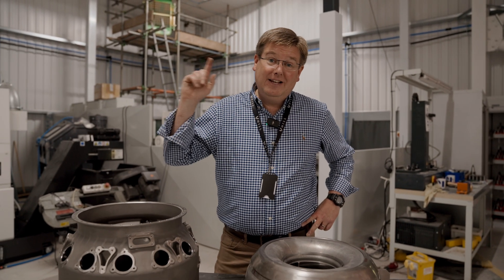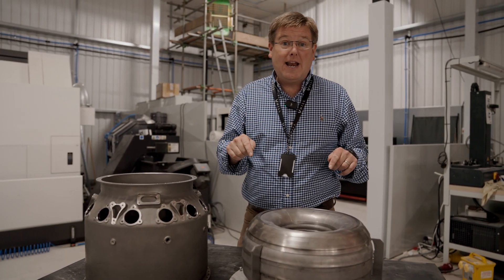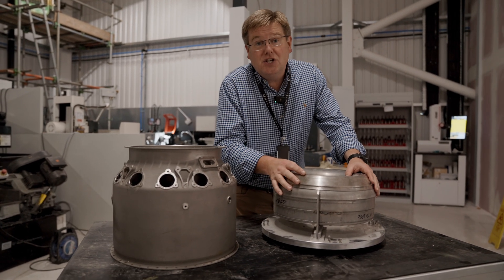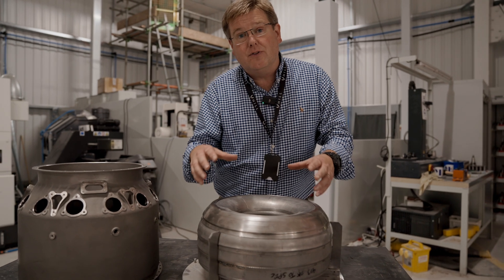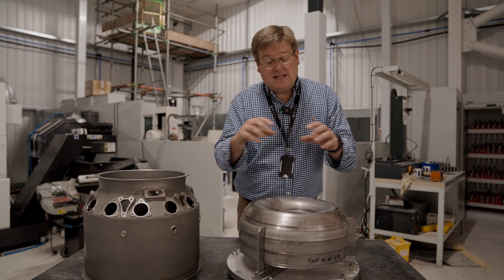With the compressor wheel in production and turbine blades in production for both prototype and series production, we need to just finish off the combustion liner now. You've watched us over the course of the last nine months or so develop all of the processes necessary to make the complex sheet metal fabrications out of super alloy. The final piece in the puzzle is to be able to produce high-integrity welds to stitch all of this together. We've opted for a laser welding process and subjected some test samples to a bunch of structural tests over the last couple of weeks.